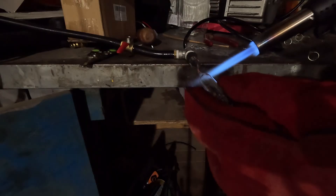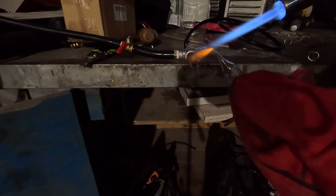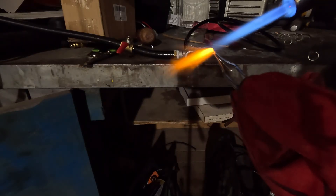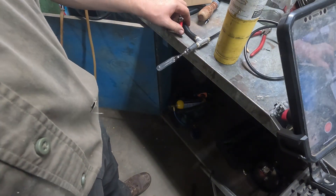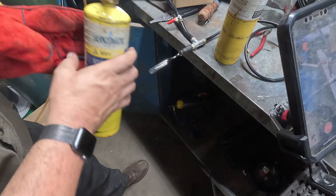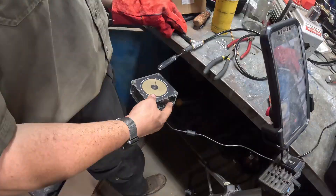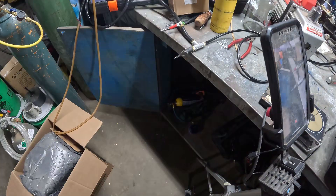Now the process for actually making these glass ampules: I would have them preheated to about 200 degrees, put it on the vacuum chamber, pull a vacuum on it about four to five different times, breaking the vacuum with whatever gas I'm trying to put in there, heat up the neck of the glass tube till it pulled in, then keep the torch on the tip of that nub until it turned into a nice little ball so it did not have a pointy end. The first glass tube I made used pure oxygen, then I switched over to CO2, dry nitrogen, then finally nitrous oxide. Once I got the habit down, I just repeated the process about another 40 times.